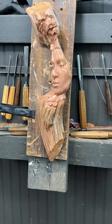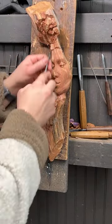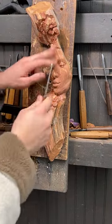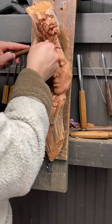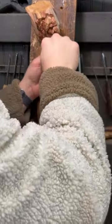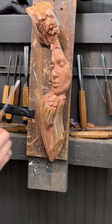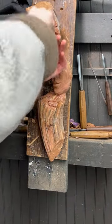What do I sharpen with? I have a number of different tools. Oh, not in the description, I lied. In my YouTube video, if you search my name and sharpening, I've got a pretty straightforward video there, maybe a little bit longer. I describe the tools that I use and the process. I don't want to get into that now because it'd be a bit of a distraction, but absolutely, check that out. The tool is called the Worksharp 3000, and it's a nice tool. I like it a lot. It's a spinning glass disc that has sandpaper you can mount to it. That prevents the tools from heating up too much. It spins at a slow pace and the glass absorbs the extra heat, so that really helps as well.